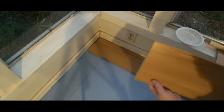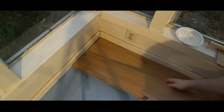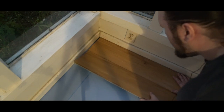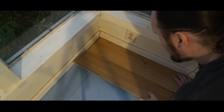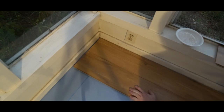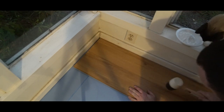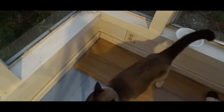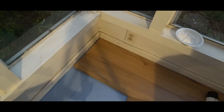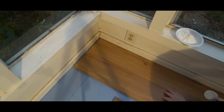Starting the next row — once again, the side without the bottom lip, or in this case the side that's cut, is what we want to line up with our other piece here. I need to be as exact as I possibly can. Push down, get it clicked in. Get your Coconut out of the way — that's very important. Take your sacrificial piece and give it a couple of whacks just to be sure. We're looking good.